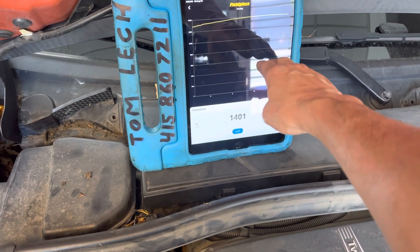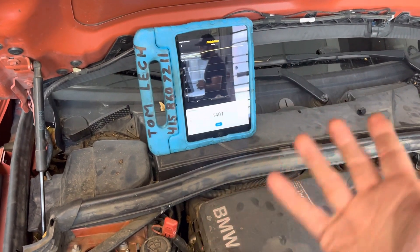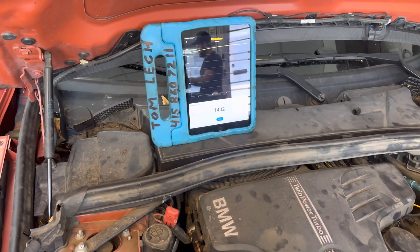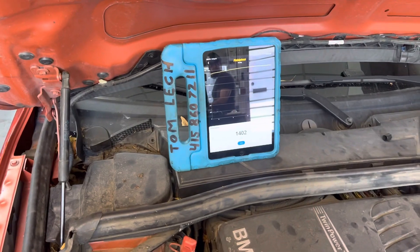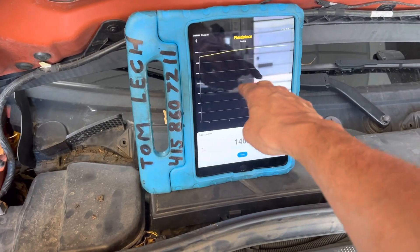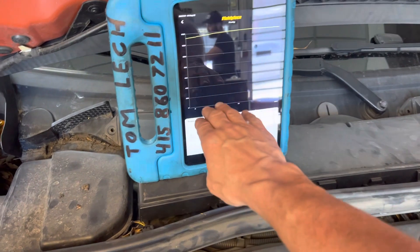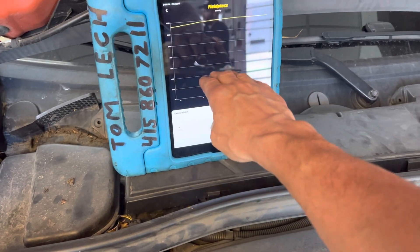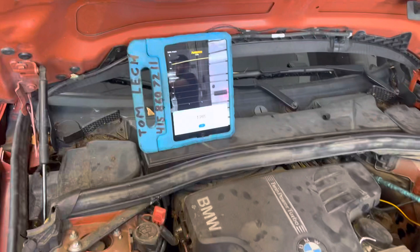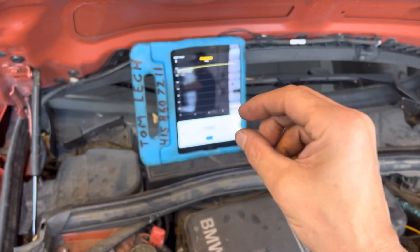You might see the second time it stops at 600 microns — that means you're almost dry, pretty good. Good enough for government work for a car. But if you have the time and want to experiment, leave it on the vacuum pump overnight and see how low you can get. Then valve off the vacuum pump — remember it came down to 600 microns when it flatlined. Well, after going 24 hours, when you turn off your vacuum it might go up to 480 or 510.